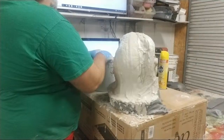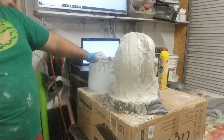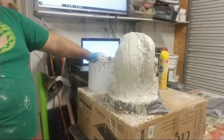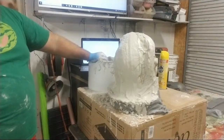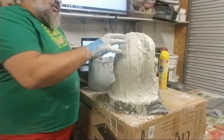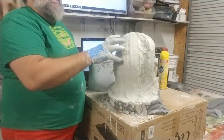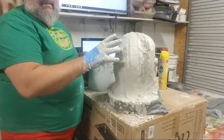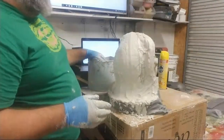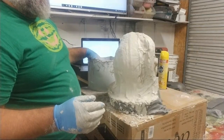What's that? Acryl 60 is an adhesion promoter, making sure that your layers bond together, and it is called a bonder fortifier. Gotcha. So it fortifies the plaster, making it a little bit stronger, because along with the crystalline connections of plaster, you also have elastomeric connections of the acrylic bonding. Makes sense. So it makes kind of a plasticky web inside. But it helps.